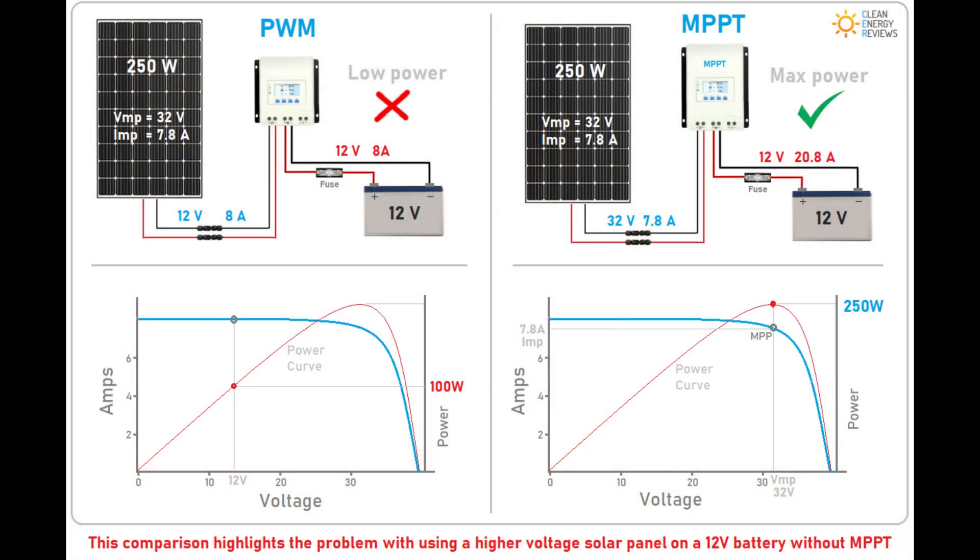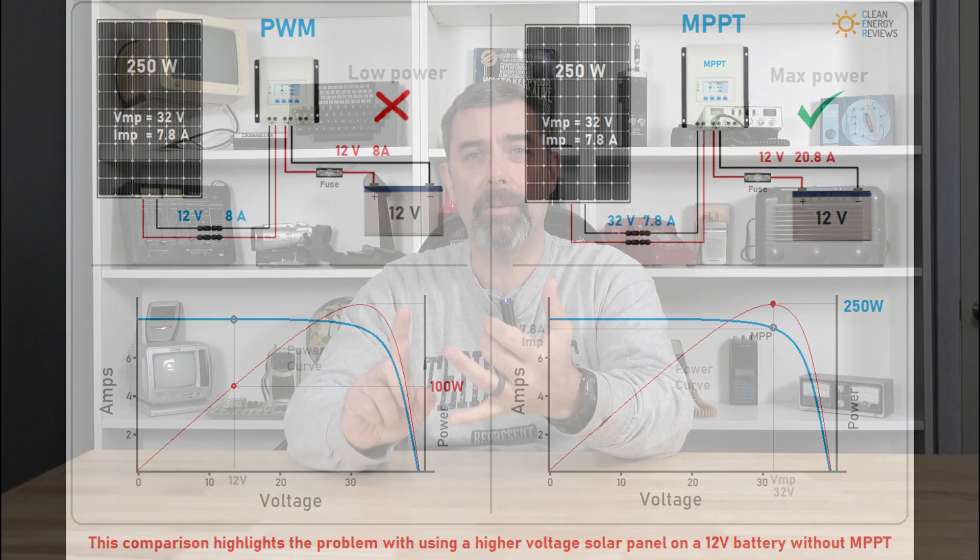What you need to keep in mind is that an MPPT controller is probably your best bet if you're talking about many hundreds of watts of solar charging. In my case, I have a 1,200-watt array right now and we're building this into something far larger. The MPPT controller allows me to take in a lot more energy. So for permanent installs — if you're going for something that might run a refrigerator, a microwave, or even a well pump — that extra 11% more charging can make a big difference over a variety of cloudy days. If you live in the Pacific Northwest where you get a lot of heavy rain and cloud cover, MPPT controllers would be an easy pick.